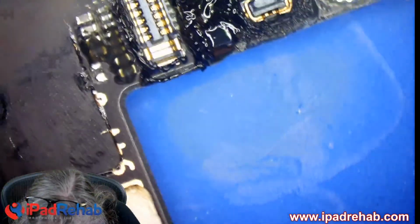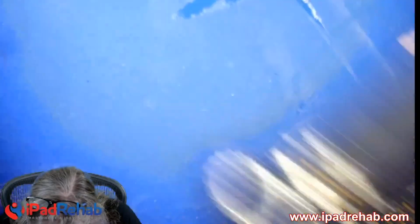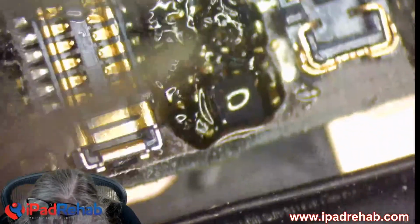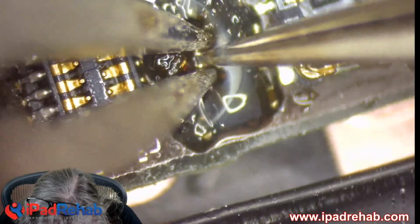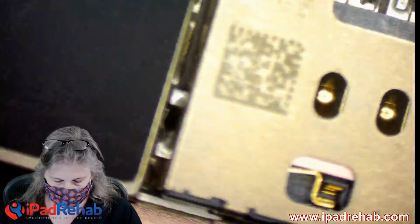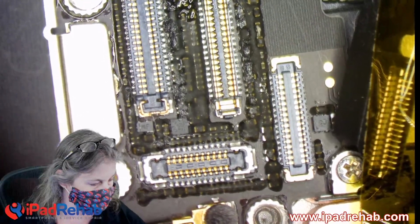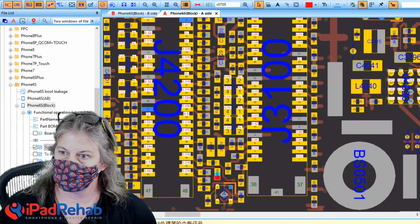All right, let's see what happens if we grab this. This is the correct dude right here, and go back to our board and see if we can get it on here in the right spot. That's a little pesky bugger. All right, did that work or not? I don't know. Let's see if we have restored our diode mode reading to good old pin 42. Now I've already forgotten which one was pin 42. So let's see. Let's go back here so that I can see what you see.